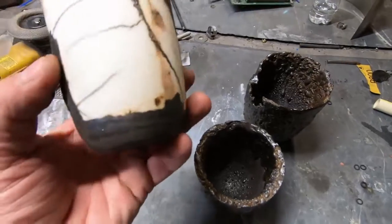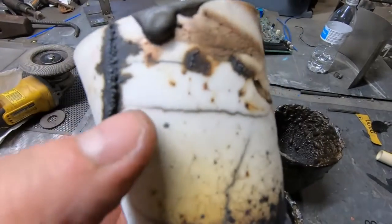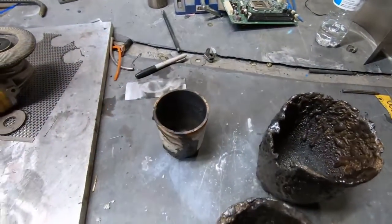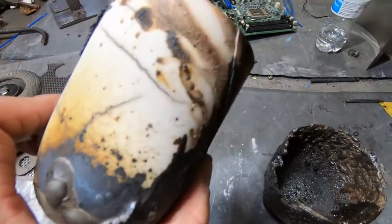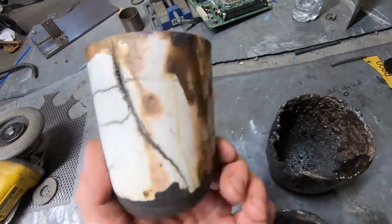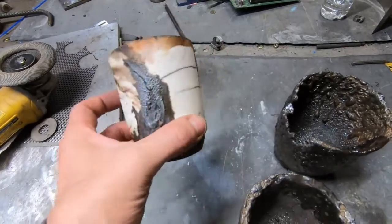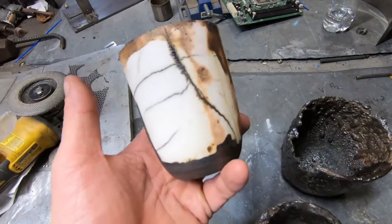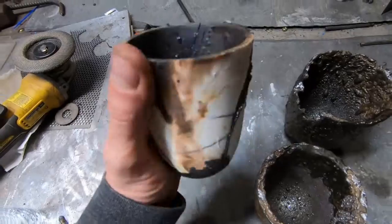Here's the end result — based on the cracks I'm seeing, I believe this is stress corrosion cracking, possibly caused by the flux or something in the mix that caused this crucible to break up. That's $35 down the drain just so you know not to do it. The thinner Amazon version did the same thing — I got two runs out of it, though it was thicker. If anyone knows about these particular types of crucibles — I know they're often used in ovens with maybe no flux — I'll have to look into that. Just wanted to give it a try and see how it worked out.